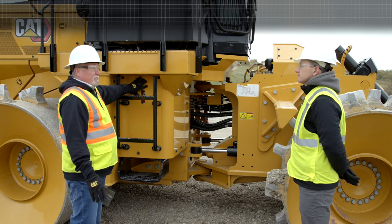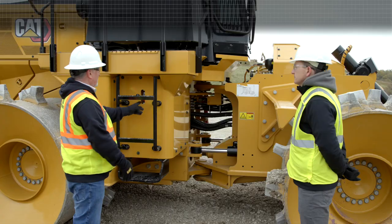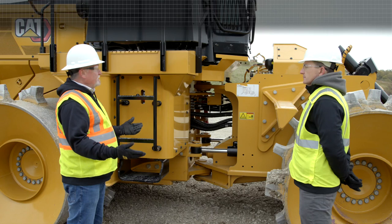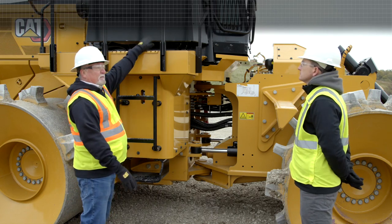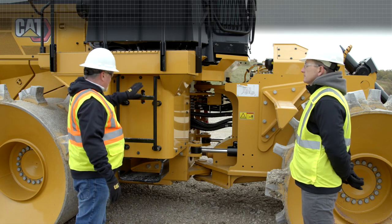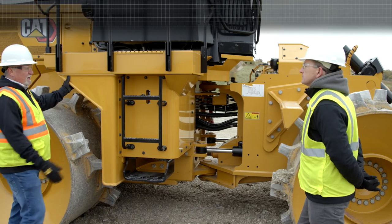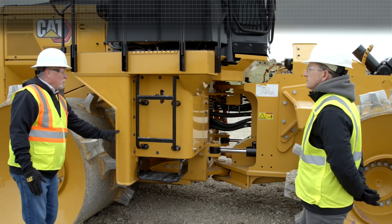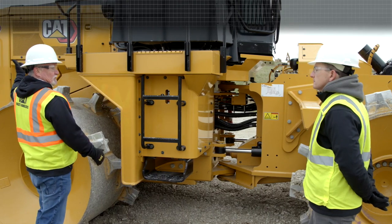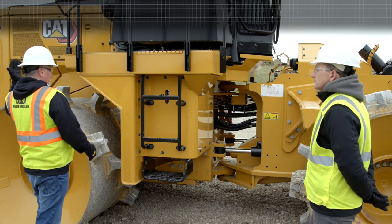The hydraulic tank, because it is behind the armor, has a sight gauge that's very visible. Should you need to fill the hydraulic oil, you climb the ladder up here and up on top is a filler tube — you lift up the little platform, fill it up, and come back down the ladder. Here on the rear, the same as the front — we have the deflector, a heavy duty steel plate to deflect the material that might be climbing up, protect the cab, protect the operator, and deflect the material out.